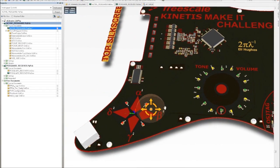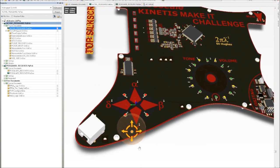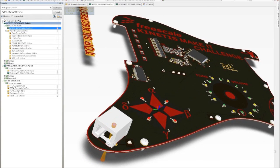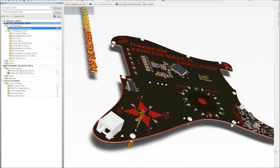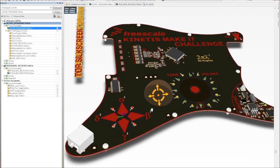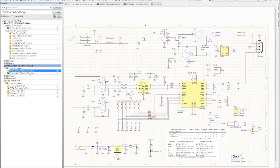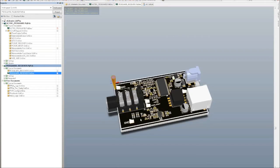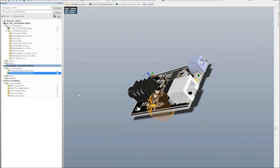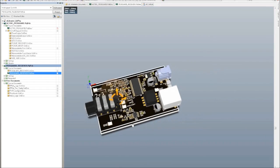So one piece that you didn't see in the demo video is the other side of this, the receiver box. So I have a Cat6 jack here. Well, this has to go to something that feeds power and gets the balanced line signal. So I need the receiver box, and here it is. Quick schematic. It's just a little circuit board, has an Ethernet jack, power adapter, some LEDs, and a nice Amphenol audio jack, which they so graciously donated.